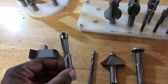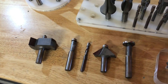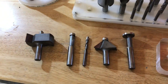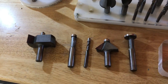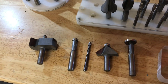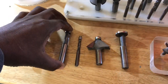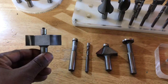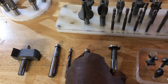And then I use the half inch flush trim bit just because when wrapping panels, and when you want to get in those really tight radiuses and corners to give you that radius, it makes it a lot easier to wrap. But I have a previous tips and tricks video explaining the benefit of having this when you're wrapping your panels. And of course, you want a nice size rabbet, and then your oversizing bit.